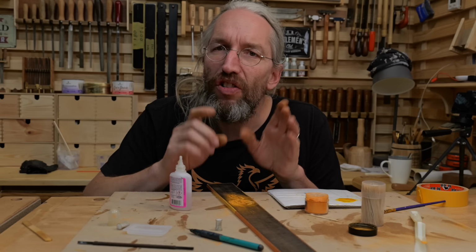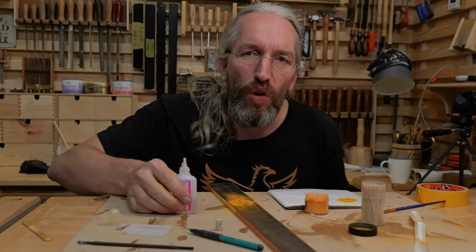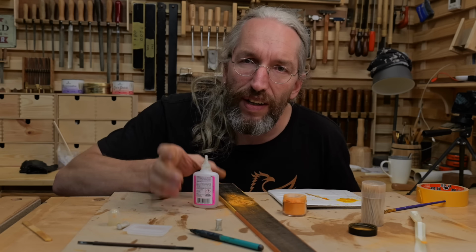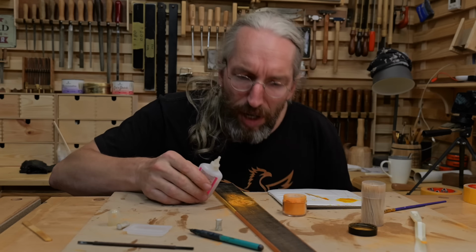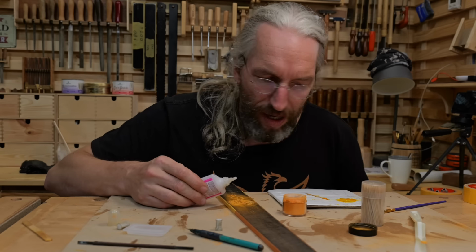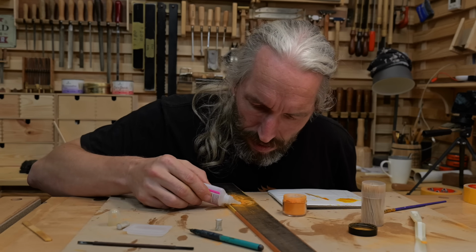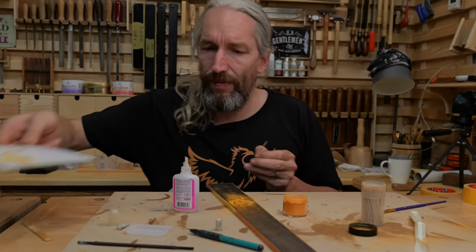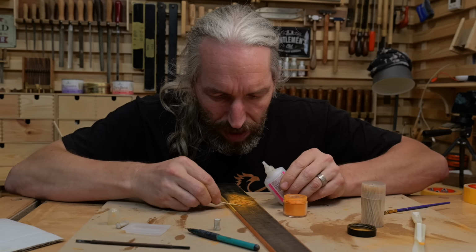All the aluminium pieces are glued into the fretboard, and now I have to hurry a bit with some thin CA glue and the mica powder to fill all the gaps before the other CA glue has fully set, because otherwise there might be gaps underneath the mica powder that's already inside the cavity. So remove my glasses, use a fresh cocktail stick, and start pouring some very, very thin CA glue.